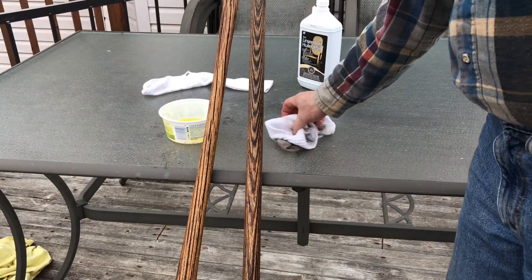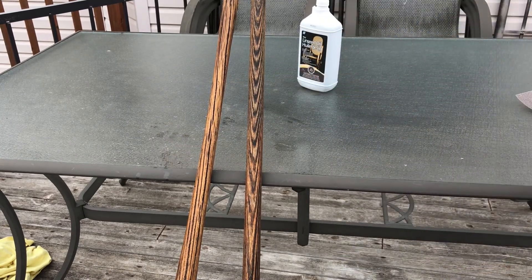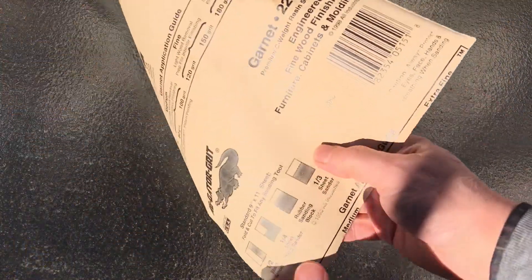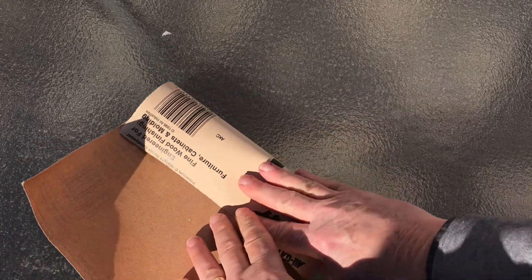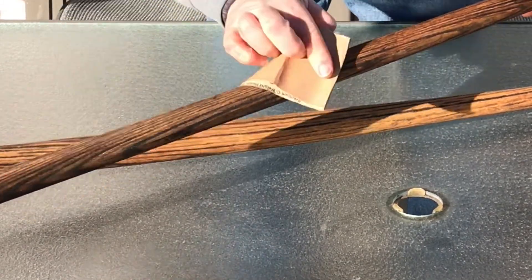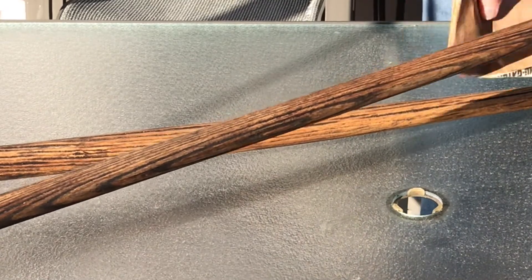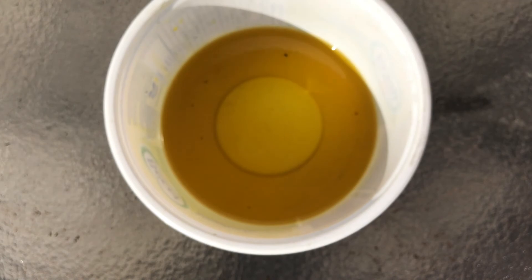After letting it sit for a few minutes you can wipe off any excess, but I find that the wood absorbs it pretty quickly. So here I've done the first coat for two of my tools. We just need to set them aside to dry before we apply the next coat, usually a day or two. Once it's dry to the touch, we can use a finer 220 grit to lightly sand the surface and ensure it's smooth to get it ready for another coat. The oil may have raised the grain of the wood a bit, so doing this will smooth it out. Then we apply the oil again the same way as before.